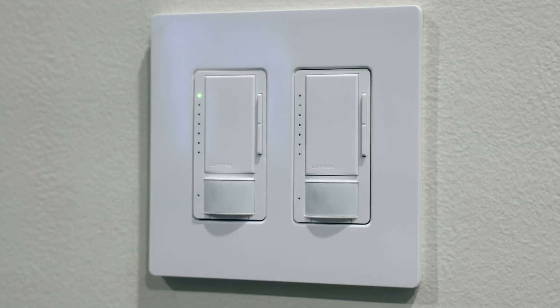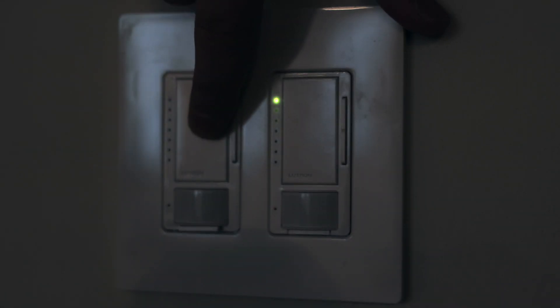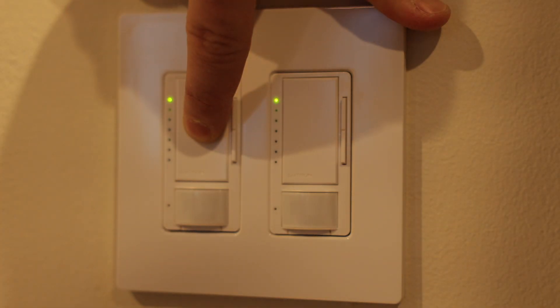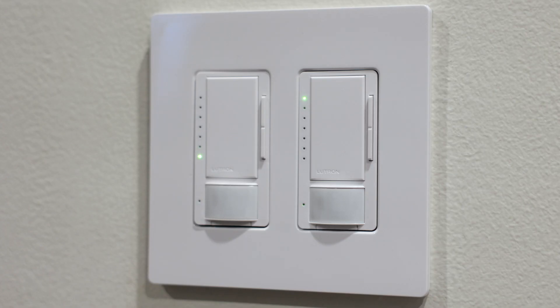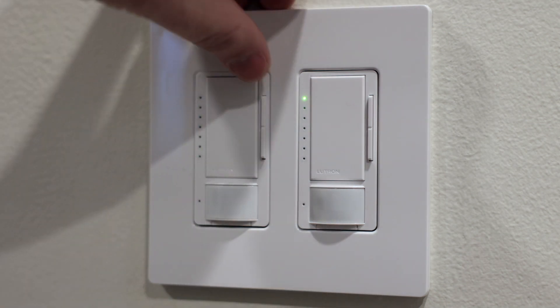What you're seeing right here is two of these light switches — they're both the exact same thing, so I'm just going to be working on one of these. To get started, there's going to be a little tab right here at the very bottom. You can use your fingernail to pull it out, and as you can see, as soon as I pulled that out everything went dark. Once that tab is pulled out, we're going to push down on this thing, hold it, push the tab back in, and keep holding it for about five seconds. There we go — now we can see that light blinking, which means it's in programming mode. If we leave it, it'll eventually turn itself off after about a minute. Depending on which dot is blinking, that tells us which setting we can program.